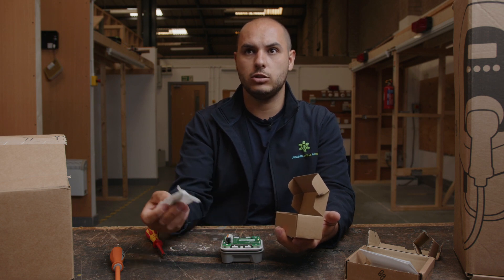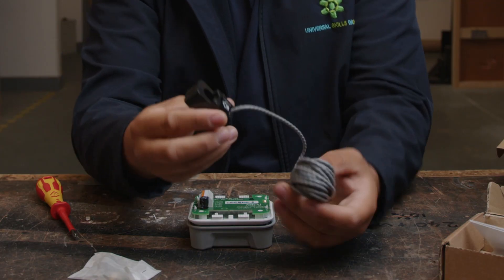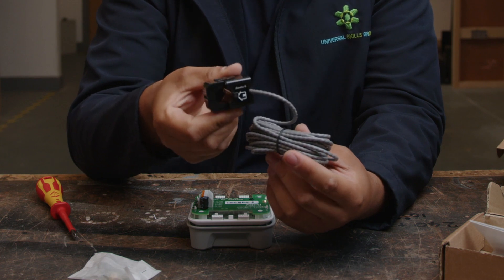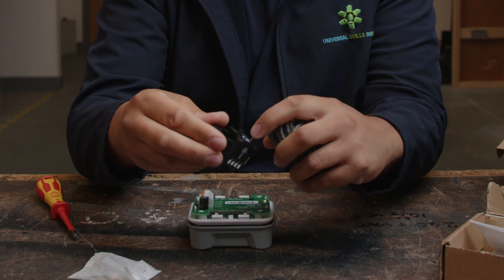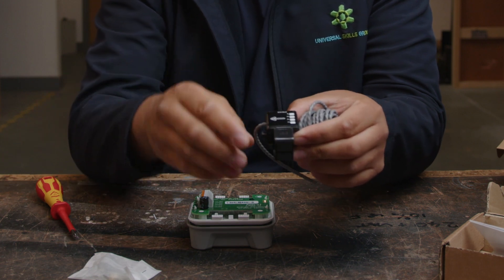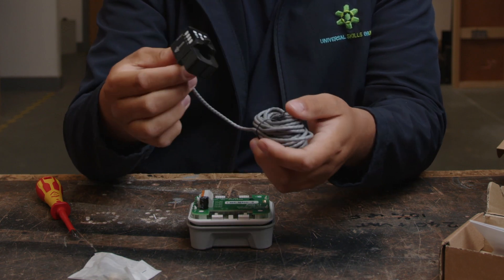With the MyEnergy kits, this is all provided as one package. Inside the box you'll be given a current transformer — a little device that clips around the mains tails. You've got to make sure that, depending how it's labelled up, it's got the house symbol there and the little arrow. That arrow wants to be pointing to the house itself, so into the actual property. Make sure it's in the correct place on the tail.